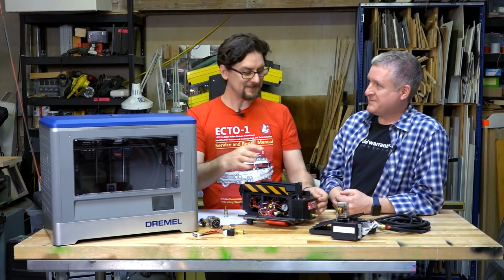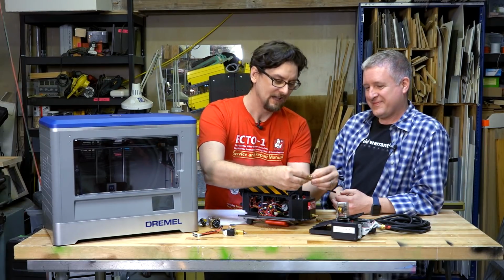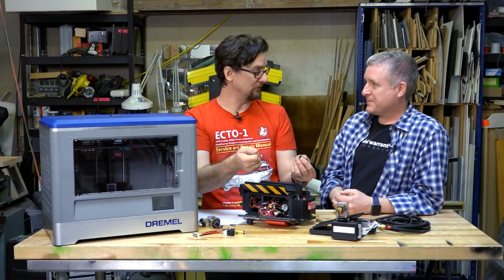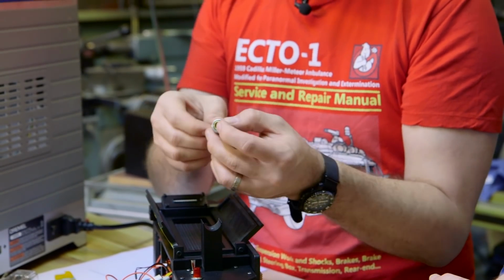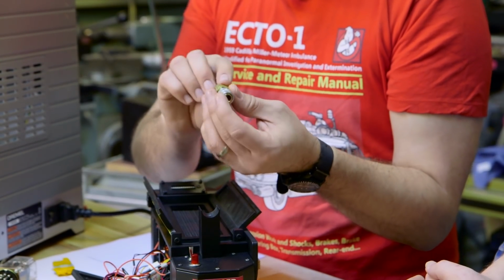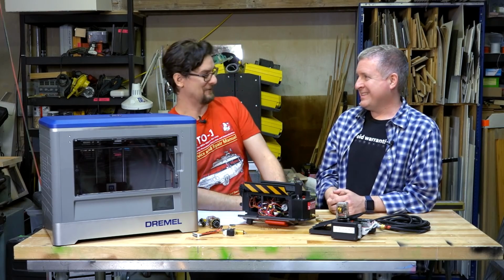Brilliant. Now that was easy enough, but then the female turned out to be a bit of a problem because there is a plunger in here that seals the pneumatic hose when you remove the air tool. So I found out you could take this apart, and it's spring-loaded, and I was lucky that there's a rubber seal. So I soldered a connector to the middle, and the rubber seal insulates it from the rest, and it made this into 2. I couldn't believe it worked.